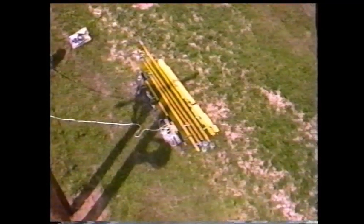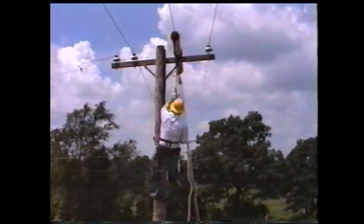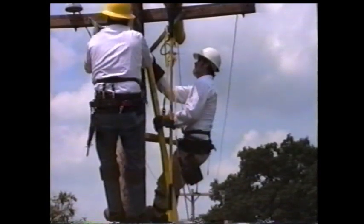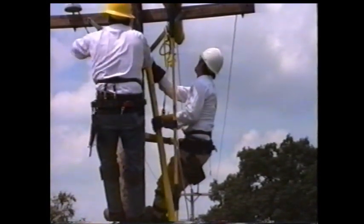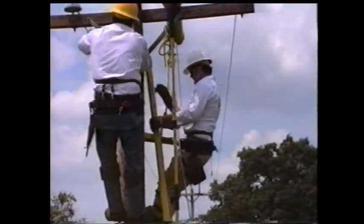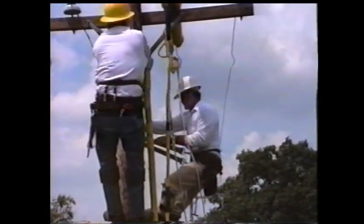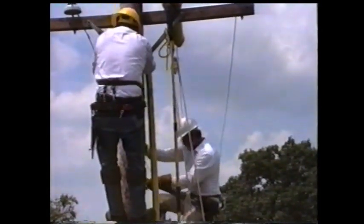Once the neutral is moved out of the work area, any phase that might be in reaching or falling distance that is not being worked must be covered. After phases are covered, mount the auxiliary sidearm on the pole. Have the wire tong snub bracket mounted to the auxiliary sidearm and mount the bracket against the pole.